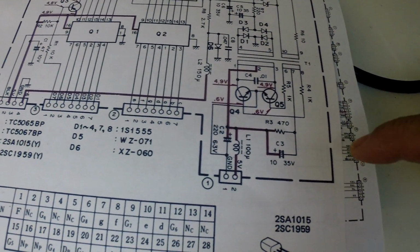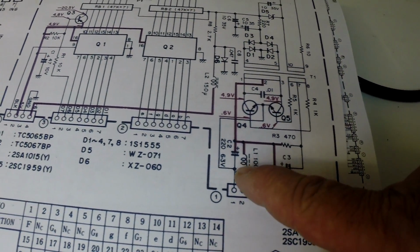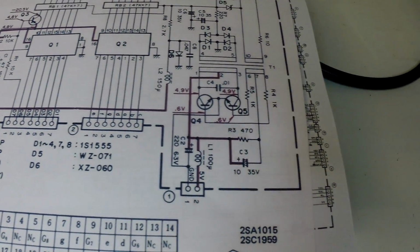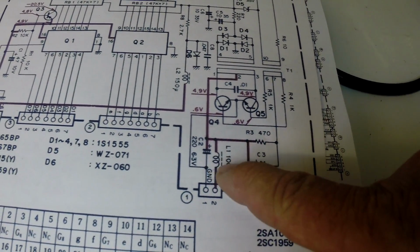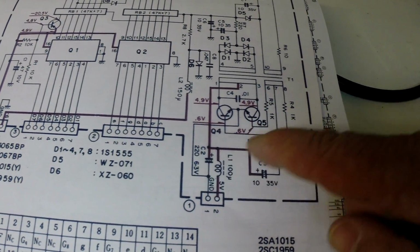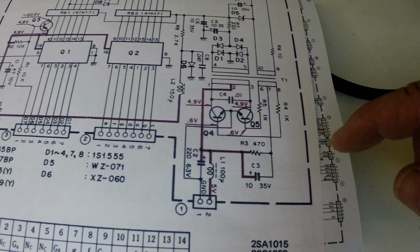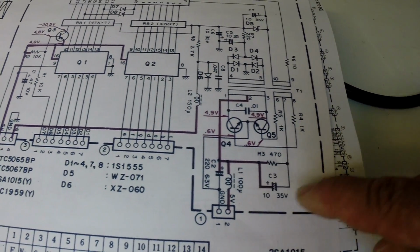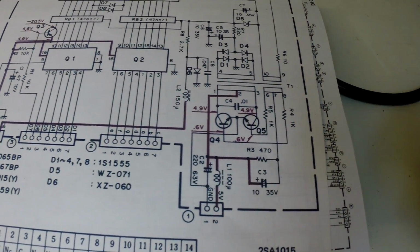So there's a few electrolytic capacitors here which are potentially a problem in a radio of this age. It's possibly it. I think the strategy will be we'll just change those out, and we'll have to order them. We don't have them in stock, so we'll order those, replace them, see if that gets rid of that noise.